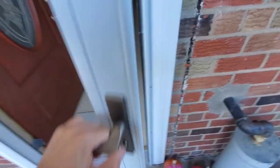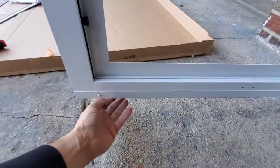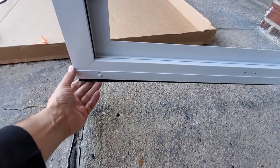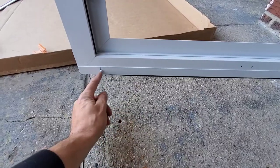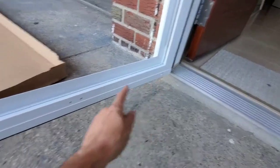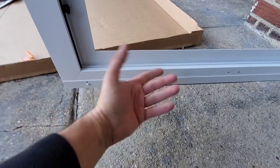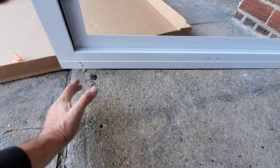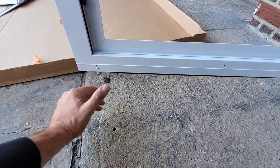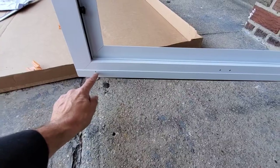Make sure this frame is tucked in when you're screwing these in. Also, I took off that clip to get the door sweep as low as possible, but there are actually adjustment screws on each side for the door sweep so it drops down even more. So I don't mind — be aware that you can adjust the door sweep using those two screws.